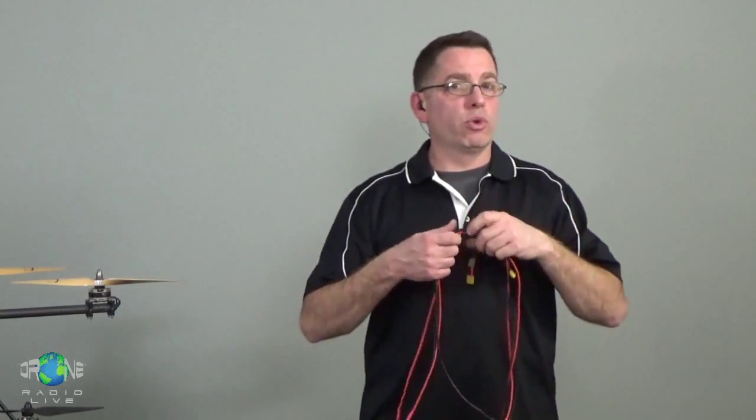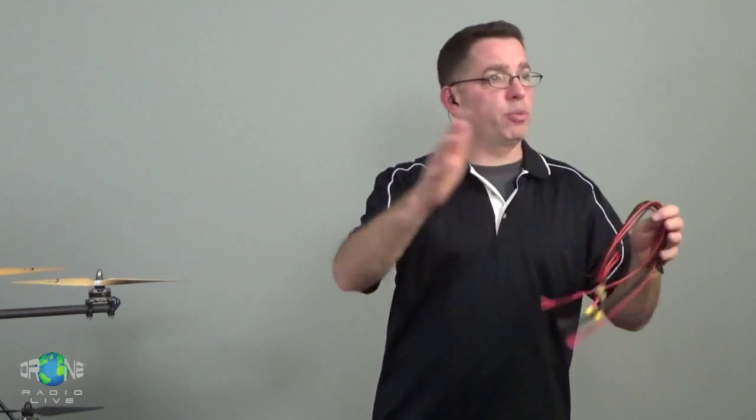It's a central point where the power is applied and then distributed out to all the different parts of the helicopter. Here's another example of one. This is a really small one by Microcopter, and it also has I2C distribution, which is a microcopter thing for the motor controllers. But you could see it's small, and it's 2 layers of copper, one on the top, one on the bottom, with an insulator in between, so there's no shorts. You attach wires to this. It makes a very clean, very easy installation, easy to wrap your head around.